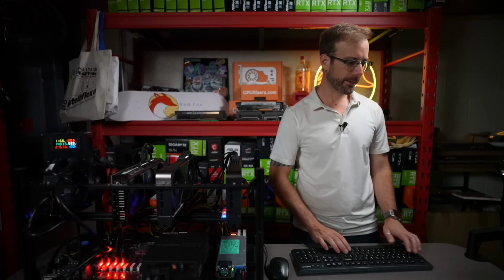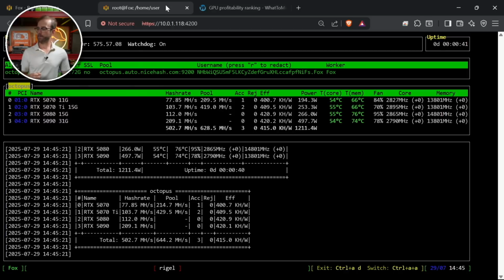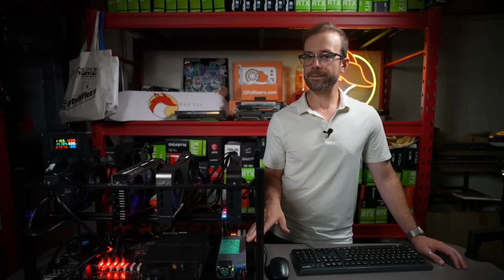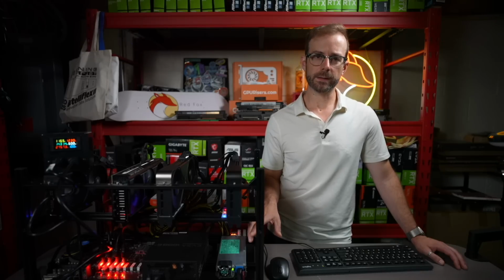But we're going to pull a ton of power right now. So let's get the miner up in Hive OS so we can hang out and do this live. And I'm keeping an eye on that efficiency column, which is going to be our driver, because I want efficiency on these cards, least amount of power, most amount of performance. And that server power supply is coming under load right now because I don't have it on 30 amp, 240. So this is going to start screaming. Should be enough though, because I'm talking 360 watts plus 575. It's going to get actually really close to the limit of what that can do on not a 30 amp circuit. So buckle up. We'll see what happens here.